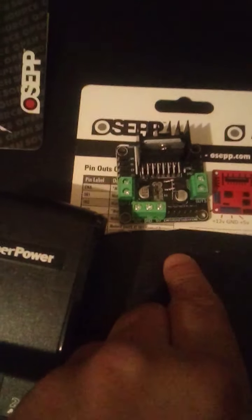But when the armature actually gets pushed or manually moved, it could blow up your Raspberry Pi. So these are great for stepper motors as well. And I suggest if you're going to use something that is going to be pushing or pulling or driving a motor, this would be the best way to go. Worst case scenario, you blow up this $10 little H-Bridge motor driver rather than your $40 Raspberry Pi or your $20 Arduino. So it always works great.